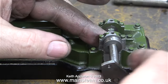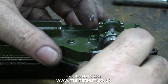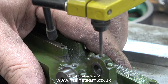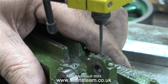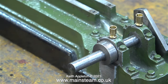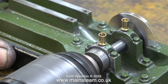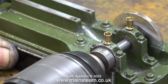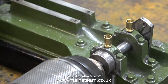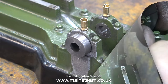First I lubricated the crankshaft, then carefully pushed it into the bushes — they fitted very well indeed. I'm quite pleased, because as I mentioned at the beginning most of this job was done by feel. I haven't forgotten to drill the oil holes in the top of the bushes to let oil through from the oil cups. There are bits of cast iron all over the place, but before reassembling I'll clean it up, paint it, and degrease it. I'm bedding the bushes in using my trusty DeWalt drill — the crank web seems to be running very accurately. The black oil that's run out is a sure sign of metal-to-metal contact as the microscopic hills and valleys in the metal are flattened off.